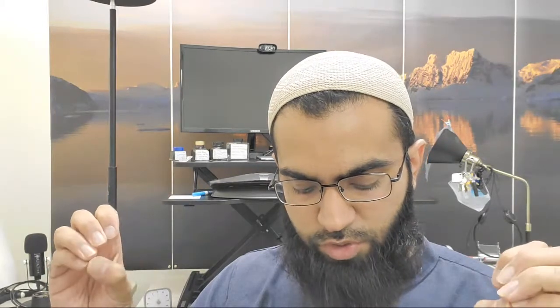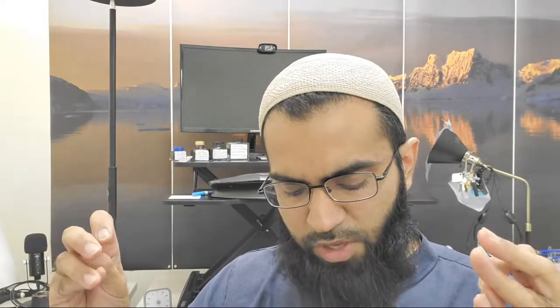One is for transient ultrasonic devices, where let's say you're sending a pulse, several pulses, and it's bouncing off some surface and then coming back. Well, increasing the damping, adding specific epoxy layers or other things that damp out the oscillation of your piezo, is going to decrease the ring time, which is going to make the transducer better able to be a sensor. It can be used obviously also over larger frequency ranges. Also, if you do add damping to your transducer, that's typically what I'll see most.